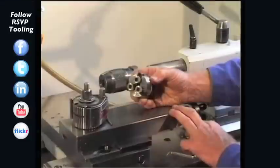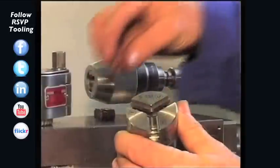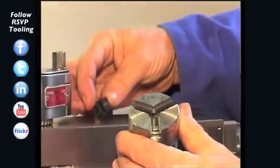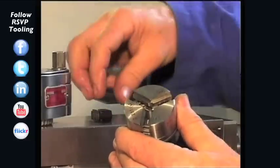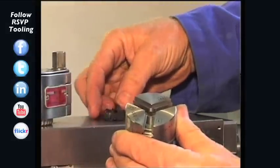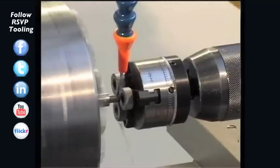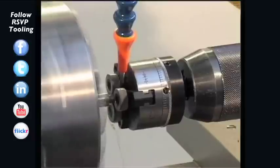The Zeus RD3 series has even more to offer. Due to its modular design, the jaws can be exchanged to working area 2, making knurling to a shoulder possible. Take care when exchanging the jaws — they have to be inserted in the correct working area as marked on the tool. For knurling to a shoulder, the tool is moved axially over the workpiece. Ensure a sufficient supply of coolant and lubrication.